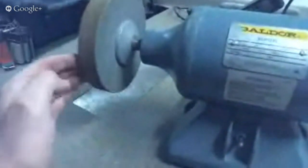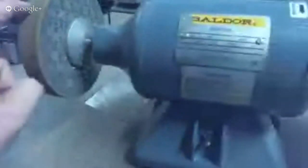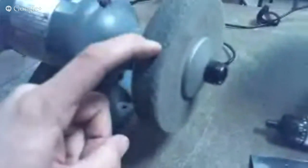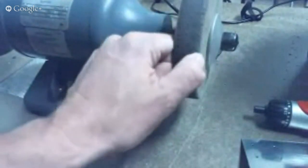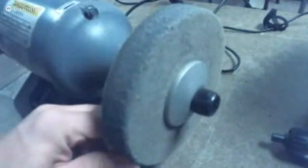The way they make the harder wheel — the most common one, we call it the cut-and-polish wheel — 3M's number is a 7A medium. They take 7 inches of material and compact it down into 1 inch of wheel, which makes it a pretty dense wheel. The medium is just the grit, and the A is the aluminum oxide wheel. The light deburring wheel is a 2 and it's a fine — instead of taking 7 inches of material and squishing it down, they take 2. So it's much softer, more like a dried-out loofah sponge, and it's a fine grit so it doesn't take as much off.